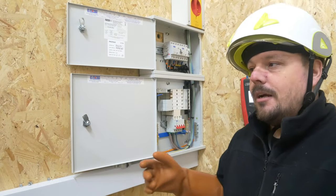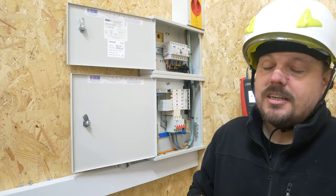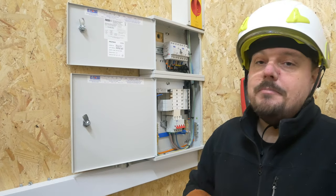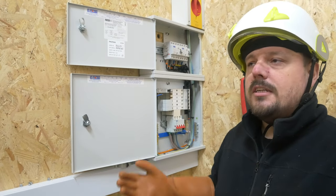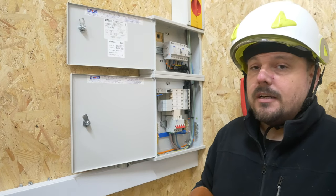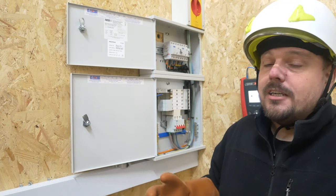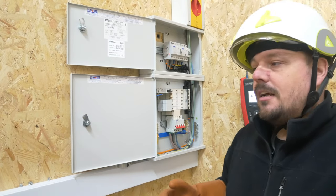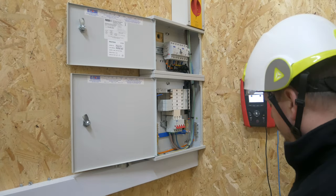Now in this case, it's really important that we are verifying that this earth path is in place after all of those prior tests, and it also includes all of the other components in this circuit now energised — your RCD, your MCBs, this main-operated switch for locking off the supply down to these booths, contactors, digital controls. All these things that can switch in after the power's been energised can now help us determine what the actual loop impedance path is. We also need to verify what our kA value is down here — that's between our live conductors for PSC and also to earth for PFC, which are different. And we can see what our ZDB is between all of those live conductors as well.